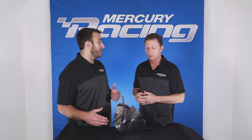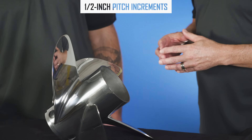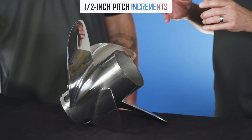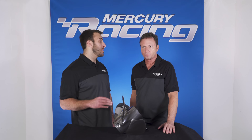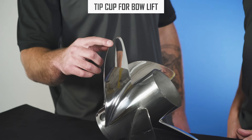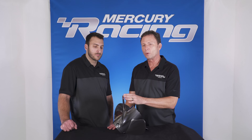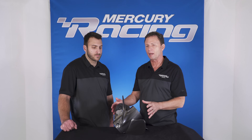This is also another one of our propellers that we offer in half-inch pitch increments, which really helps guys get dialed in. At Mercury Racing, we want to make sure you can dial in for the greatest amount of fuel efficiency at mid-range and at wide open throttle. Looking at the blades themselves, we also notice a high amount of tip cup out at the maximum diameter. Sometimes we have to add more tip cup in order to increase the bow lift — it all works together with this style of prop.